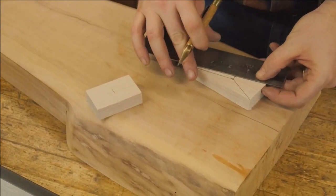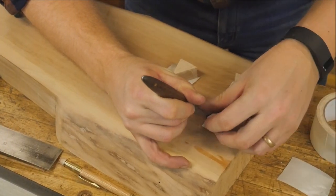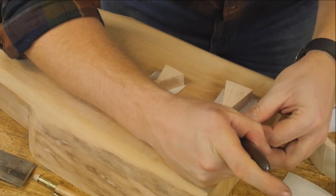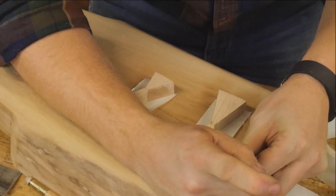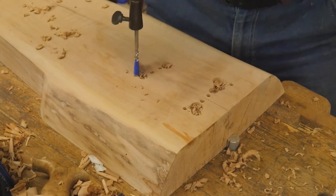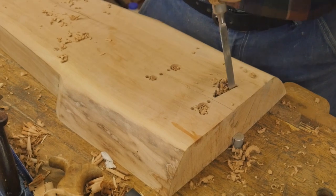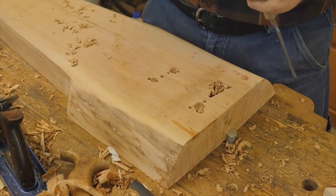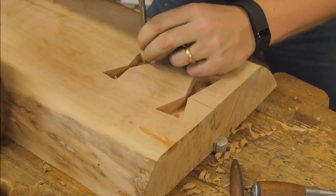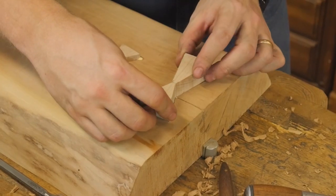There was a crack at the top, and I wanted to put a couple bow ties in that — just a simple way of sprucing it up. I draw them out on hard maple and then use a handsaw to cut to the line. I put a little bit of double-sided tape onto the wood to hold them in place and then mark out the sides, being very careful not to shoot over the corners — I don't want to mark up the wood, but this gives me a very precise measurement. I use tape on the auger bits to set the depth, cleaning out most of the waste while staying away from the lines to make it easier for a chisel to come in. I stay away from the lines until I can get really close, then clean up the very edge with the final bit of the chisel. Sometimes a smaller chisel or pick is needed to get into the space of the bow tie, but if you take your time it comes out very well.